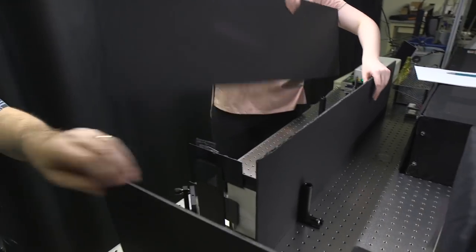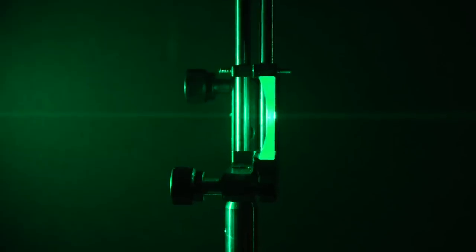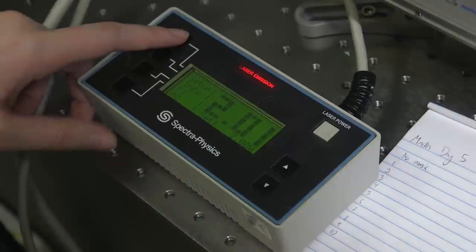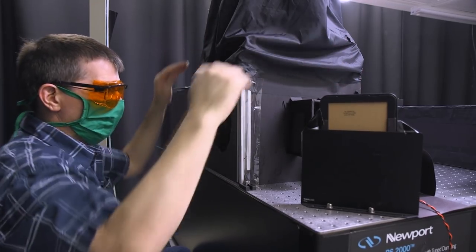So this is what's under the hood — not much. The setup is very simple. It's one laser, one cylindrical lens which turns the laser beam from a beam into a sheet of light, one mirror getting the light into the box, a box which you can construct out of cardboard, and a camera — which in this case we can use a cell phone camera. It's very straightforward and doesn't take much resources. Any research lab has these things lying around. We used a very expensive laser because that's what we had, but you can buy a laser that does the same trick for about $100 online. We have the speaker hole right here, the light sheet going in from the left side and out the right side, and the camera on the far end looking at the light sheet. When you speak and emit droplets, as soon as they go through the light sheet, they scatter light, so you see a little flash of light that gets recorded by the video camera.